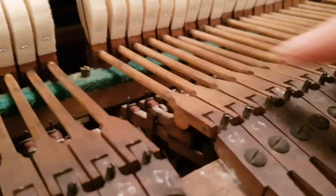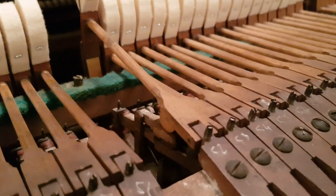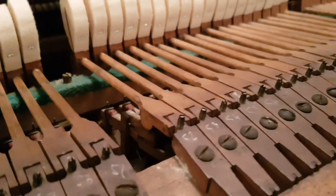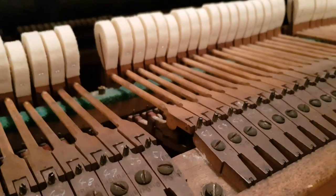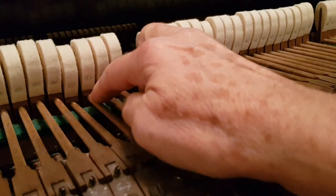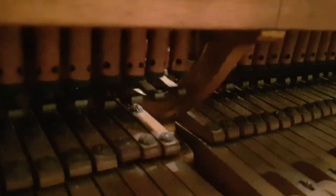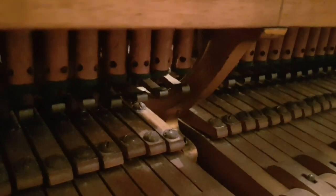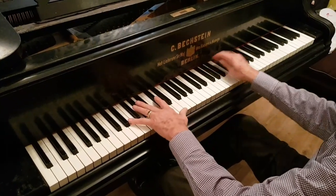I'm lingering on this to try to get more opinion on that system — I'm pretty sure we haven't done one of those before. The pins here are tight which is encouraging. Some of these key heights are very low, but I think that's just the rocker screws. Doing rocker screws seems to take more time — if you're used to them maybe you can give tips on how to do them quicker. There are no capstans here; we replace these when we do fuller restoration and put normal capstans on.